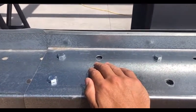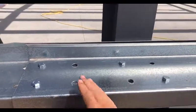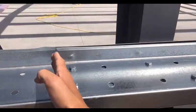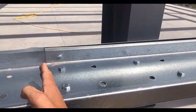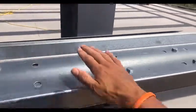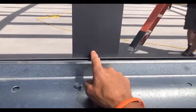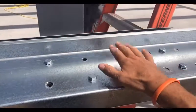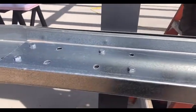On laps, if you look at your roof drawing, sidewall drawing, or framing drawing, there will be a measurement telling you from the centerline of the column to the edge of each girt or purlin. Make sure you're holding that measurement. If there's any question, just measure from the end of the girt to the center of the column and that should take care of it. We do one-foot, two-foot, three-foot, and sometimes up to four-foot laps depending on the strength required for the building.